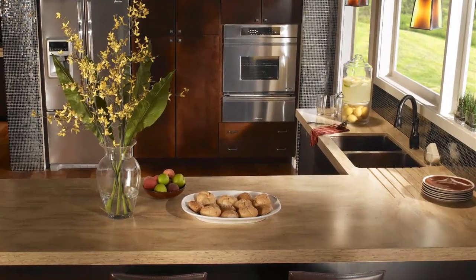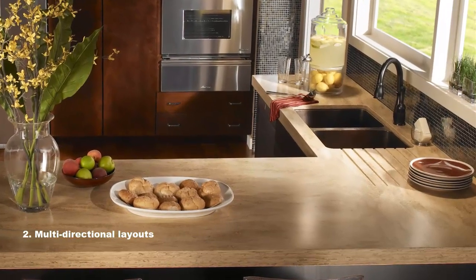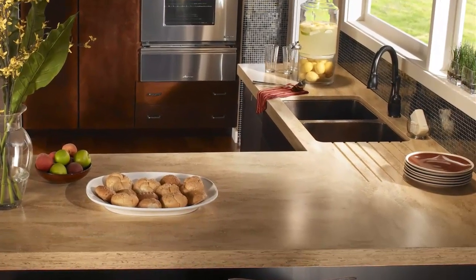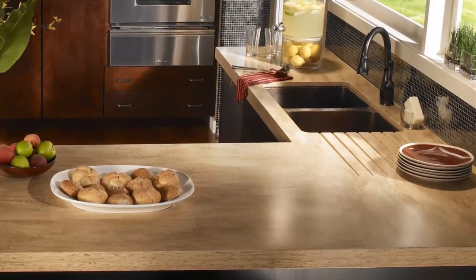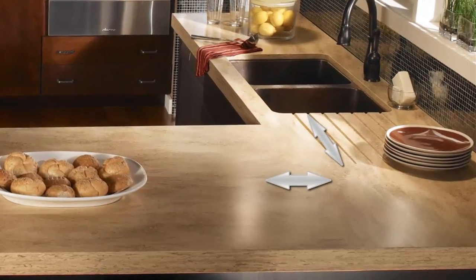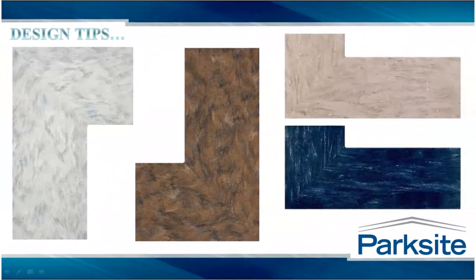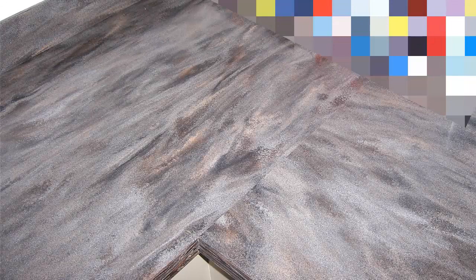The next consideration involves multi-directional layouts. Although Corian is typically known for its inconspicuous seams, with the Private Collection, a break in the pattern will be noticeable. There are two popular choices for addressing this trait. The first emphasizes the seam appearance as a design feature and simply involves a miter joint, as shown here. Notice how the visibility changes with the various colors. You can find similar photographs for each on the Corian website, and a hotlink is offered at the end of this video. A standard butt joint is generally not common, particularly with the high contrast patterns.